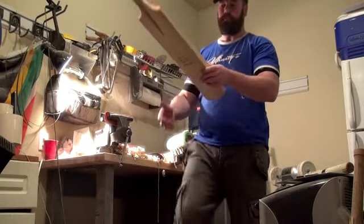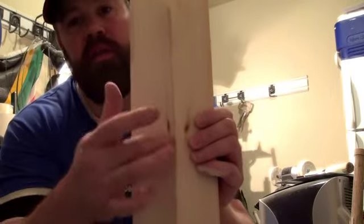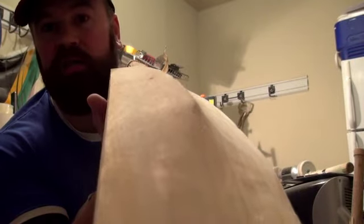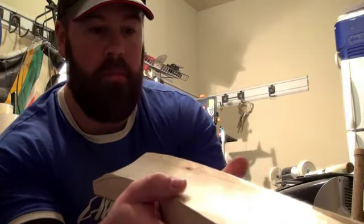I'll stop halfway through, give you an idea of what we're trying to achieve. It depends on how well you can see this. This is just the side that's had the knife work. Even when we're using the knife, we're trying to make it as smooth as we can without going too OTT, because as I say, I haven't got drum sanders here. But the point of using this 80 grit to begin with is it gives me a good indication of whether I've got any high spots or low spots that I need to work out. So far it's not too bad. Obviously still have this little area to address, which is going to run from here. It's behind the face, so that's not a huge issue. But so far, touch wood, it's not too bad.